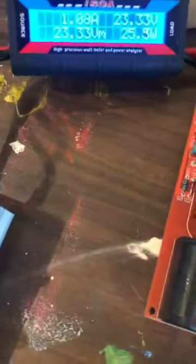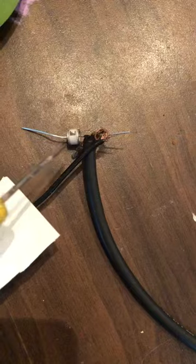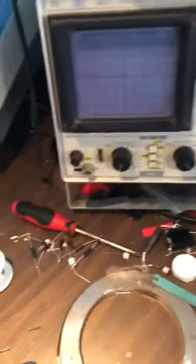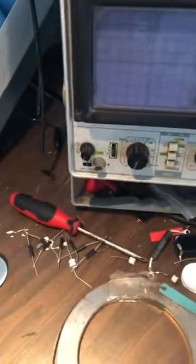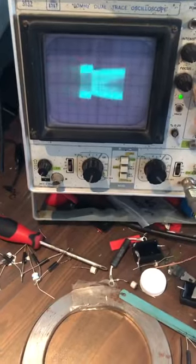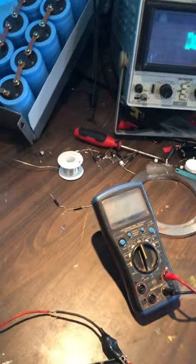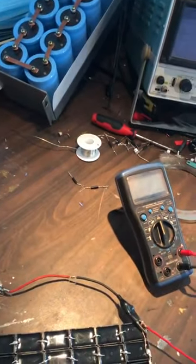So there's 25 watts. We have no spark gap on the earth ground on the high side here, no spark gap on the midpoint grounding. You can see that we are disruptively discharging through this coil. This spark gap is running — hard to see, but it is. Most amazing trumpet wave in this configuration. There's a lot less difficulty to achieve a trumpet wave.